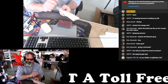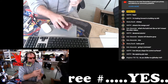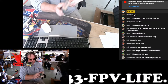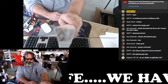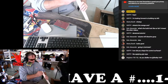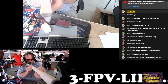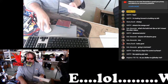You can take a handheld one, go bzzz and all that, but I don't know. Get to know your frame. Don't worry about any rough cuts like right there; all that's just going to get sanded down. Already you can see it starting to round just a little bit from what it was. Before, it was a sharp right angle. You'll start looking down the whole edge and making sure that you're sanding evenly. You'll tell if you're sanding one spot too much.